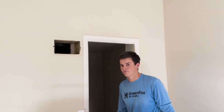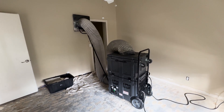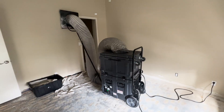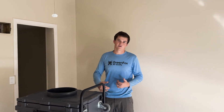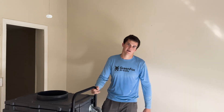Get that nice and clean. After we vacuum the cans and the trunk line, we hook up our negative air machine to the duct system and feed in a 20 to 30 foot rotating brush end to kind of stir up anything that we couldn't reach by hand with the vacuum. And then after that, the duct system should be pretty clean of any dust or debris, so we run through and we encapsulate it with our IQ8000 encapsulant.